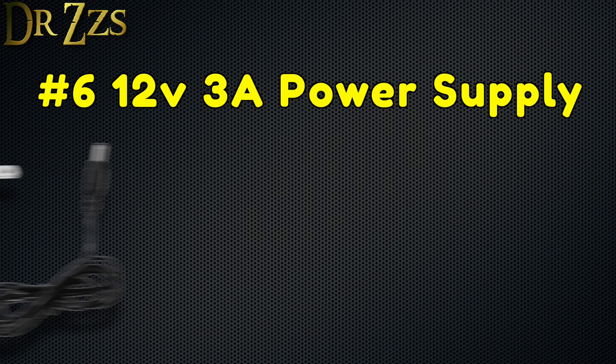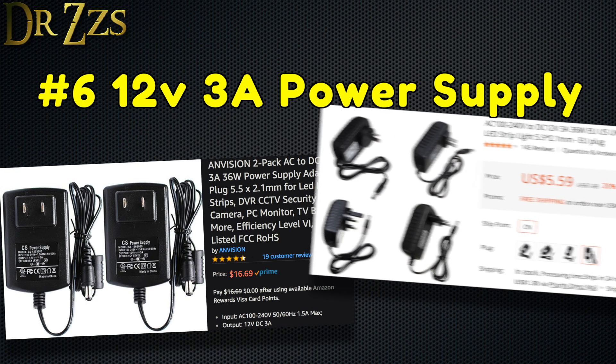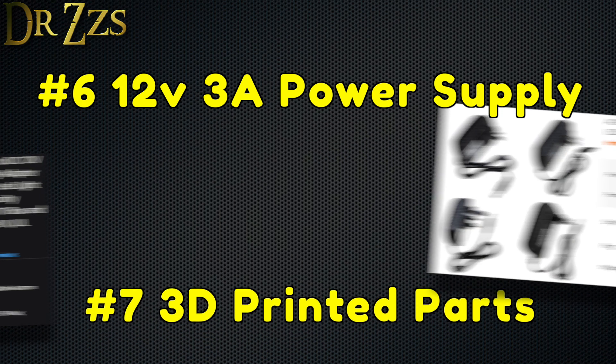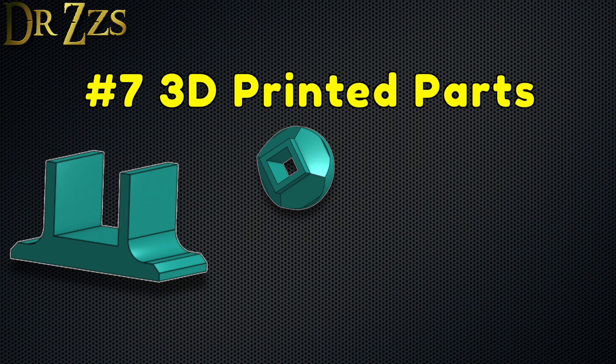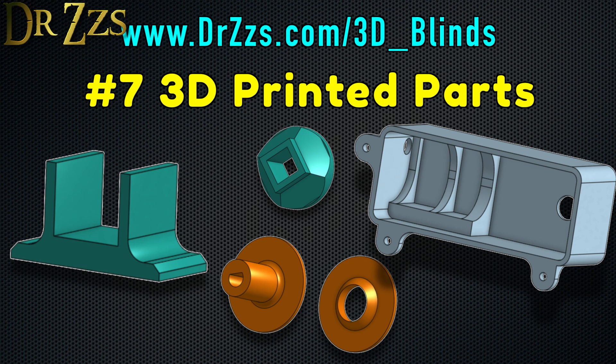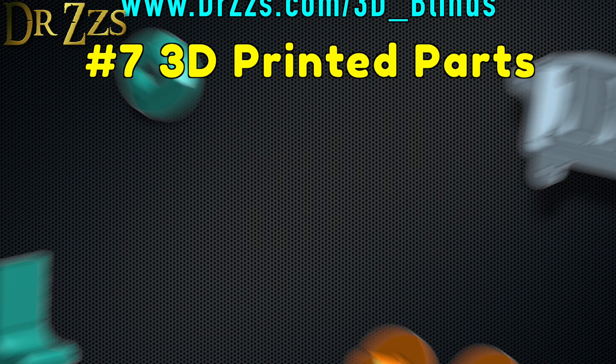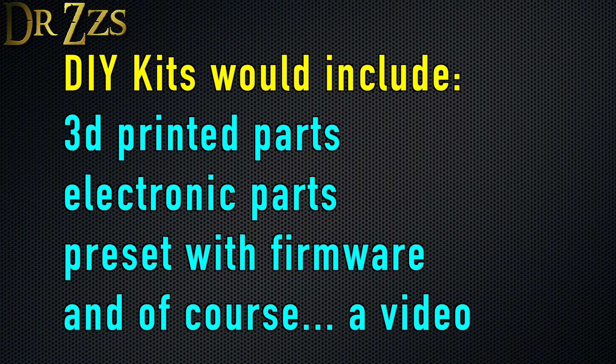Number six, a 12-volt 3-amp power supply. You might be able to get away with less, but you won't really save any money by getting the 1-amp or 2-amp version. Cost, about $6. And finally, I'm using a 3D-printed servo holder and gear adapter, string spool, and motor housing. I'll make the models available if you want to use them. If you don't have a 3D printer, you'll have to get creative with how you secure the motor, attach the servo to the tilt shaft, and attach the spool to the lift motor shaft. I've been considering ways to make parts like this available as a DIY kit. If that's something you'd be interested in, let me know in the comments or on Discord.